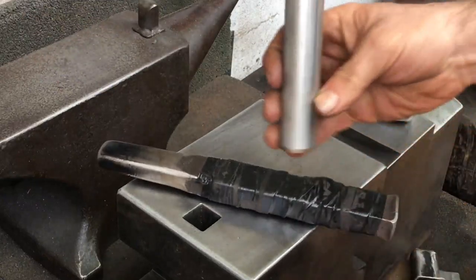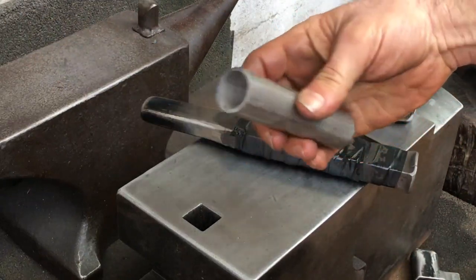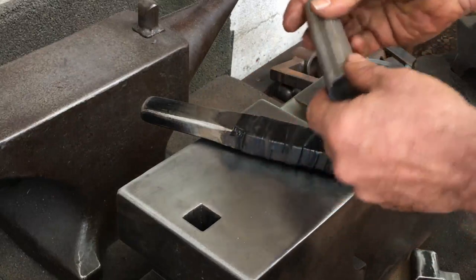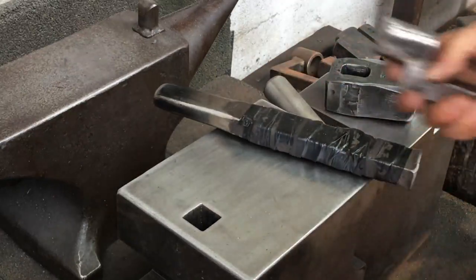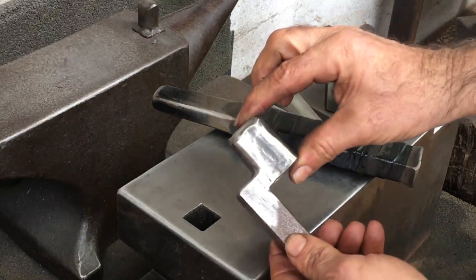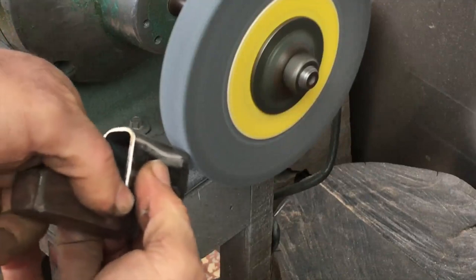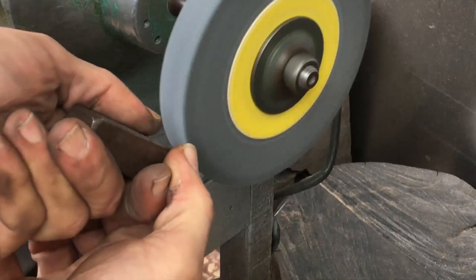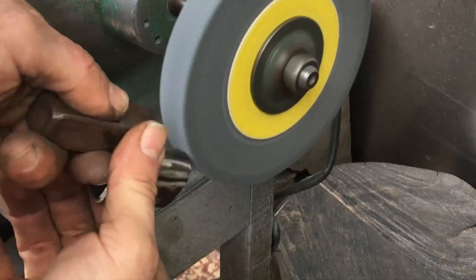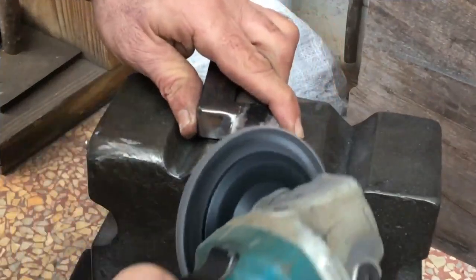I have this piece of stainless steel tubing and I shaped a short length of it around my final drift. Here you can see that with a hardy shank welded on, I shaped a cutting edge around the perimeter. One way you can tell this is stainless is by the lack of sparks.